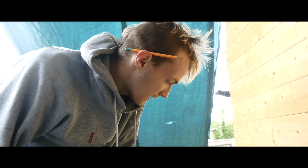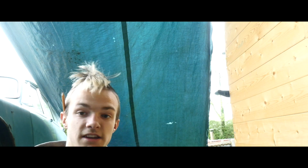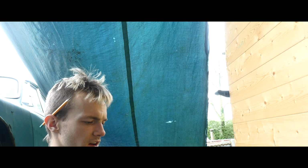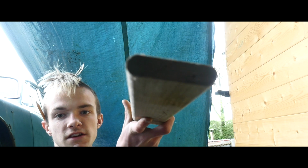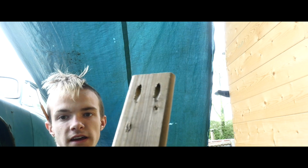So, yeah. But today's job is the bench seat. Obviously I have the bench seat where you sit at the table, opposite the kitchen. That is currently, the face of it is still just a frame. So I've cut these 4 bits of wood, not pallet wood, they're just sort of strip wood. Like this one's like the slats I use, which is nice and round, and then these ones are just square. But I pocket hole them, as you can see, there and there.